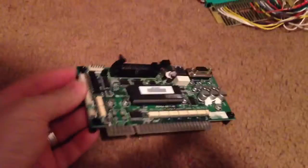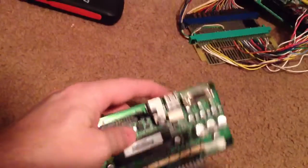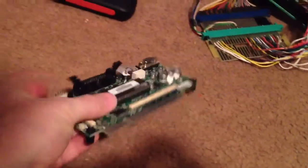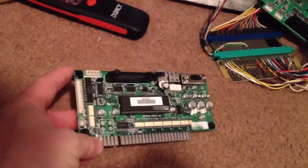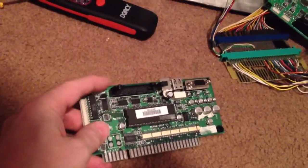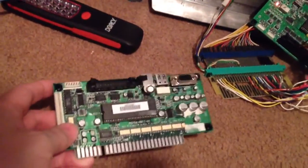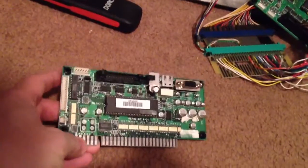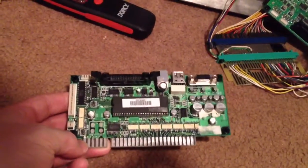What you see here, this is a Sega JAMMA I/O board. USB from the NAOMI comes in here, and it connects to a JAMMA harness. The JAMMA harness, if it has power, will power this. Otherwise, you need to use one of the other connectors to give it power. I had been running it in my Blast City, and it interfaces the controls with your NAOMI.